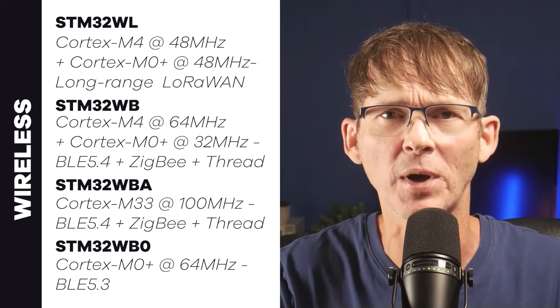There are so many different versions of the STM32 that it can be overwhelming, so now I want to break it down by different priorities. We'll look at units where performance is a priority, where low power consumption is a priority, where security is a priority, where wireless functions are needed, and units that support various advanced features and peripherals. If performance is your priority, then the F and H series are going to be the highest performance.